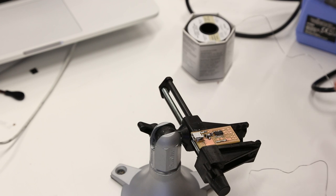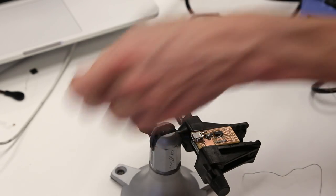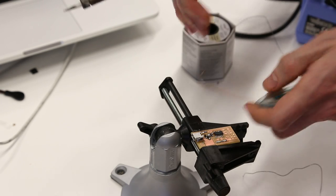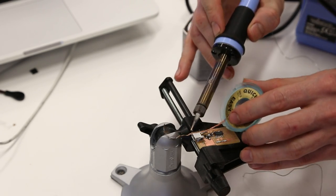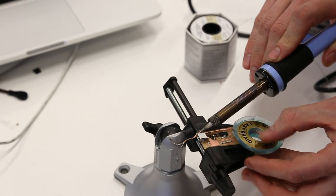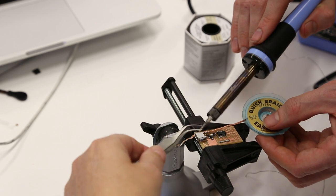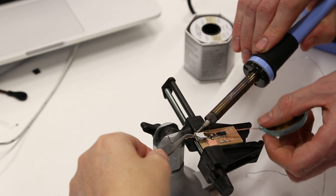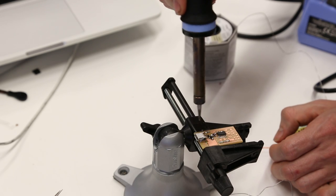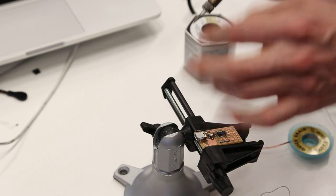That is your 1K resistor. It accidentally came off. Yeah, but I'll just put the same one, right? Yeah, but we probably want to move it down a little bit. I can't find the parts. They're somewhere around here. No, it's not going to go enough yet, because we need to first remove a lot of the solder from the outside. And then, once most of it's gone, we can try to lift it to get it off again.